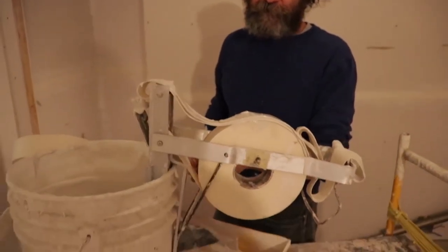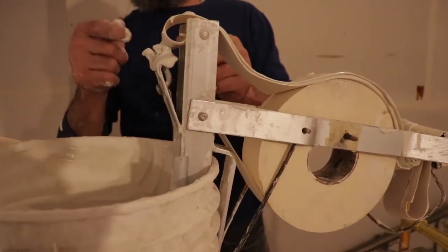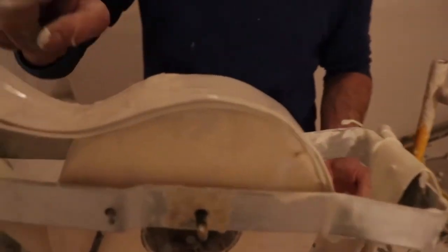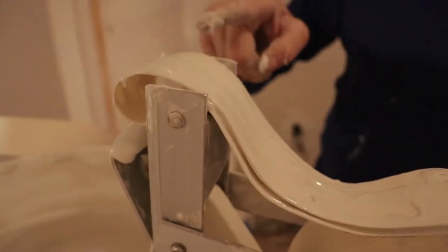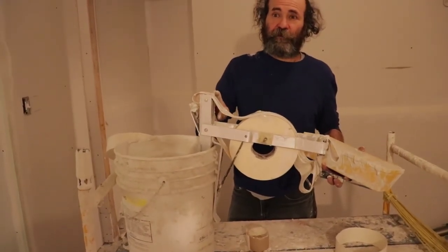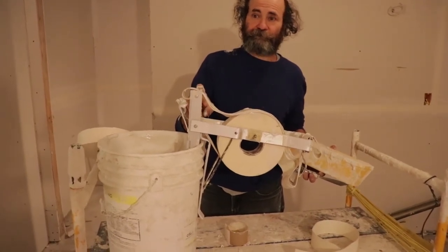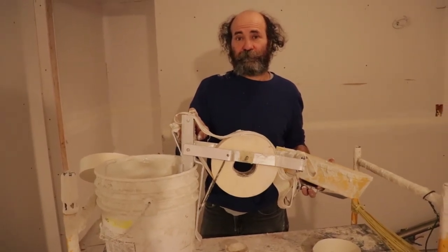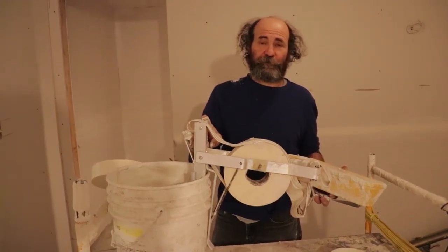Here's a regular paper fabric tape — just go inside, around it, into the mud, and it comes out just nice like this. See the amount of mud — this is a good amount of mud. The benefit of using this on a new construction is that it makes a little bit of mess, but it makes the job much faster and you can get it taped in one run very fast.